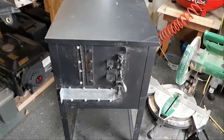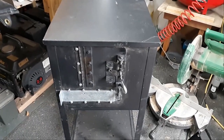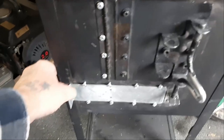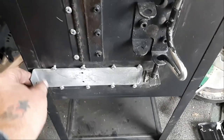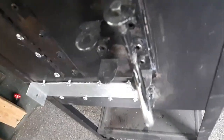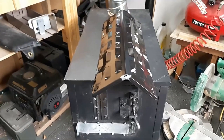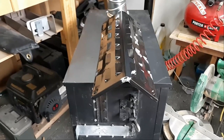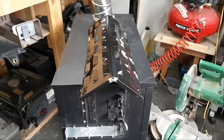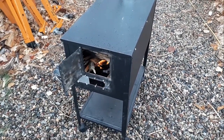In two hours we have a working stove. Whether or not it lasts any length of time remains to be seen. It's raining out right now so we won't get a full burn in, but we'll give it a try later. Here's the rudimentary little flue I made — I'll cut off those extra screws later. For a grate inside, I've got an old plate that was a heat shield on a gas stove; I think I can get it in there, bend it down a bit, keep the fire up off the bottom and get decent airflow.